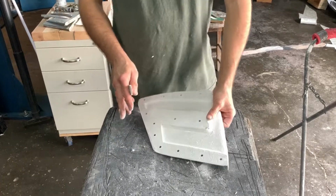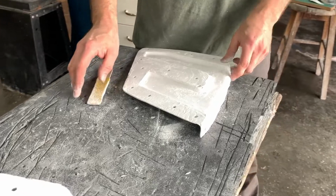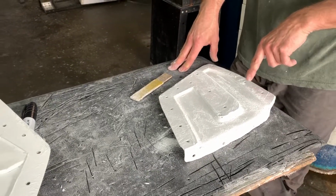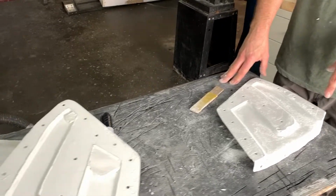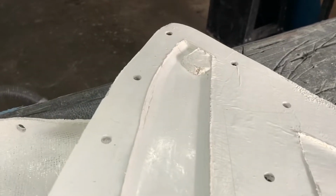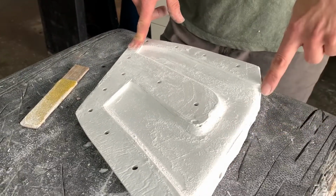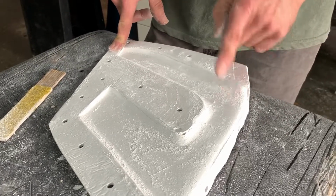What we are working on right now are wing molds for Gen 3 and 4 Dodge Viper. These wing mounts are different because these fit the convertible instead of the coupe. What's different about them is that they are a half inch extended to get a correct pitch on the wing, and they have a different contour to fit the convertible trunk lid. Oh, okay. So that's why these are different.